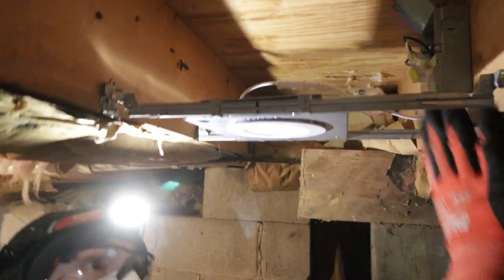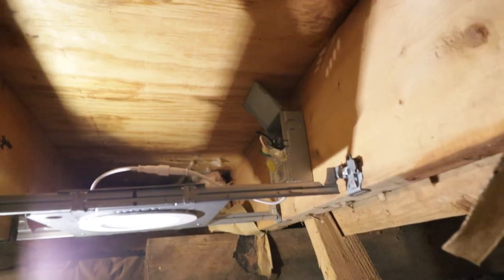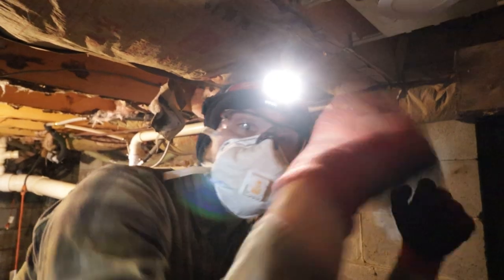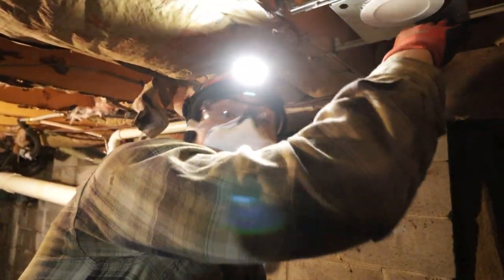So that's what the general assembly is gonna look like, but yeah, putting this definitely kind of obstructs this. So we're gonna do the rest of them like you would on a normal construction site, which John just brought up. We're gonna whip them all out, bring the wires to them, hang whips down. We'll get the boxes mounted, wired, then we'll put these up and pop these in. But yeah, I think this is gonna be pretty good.